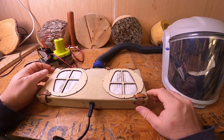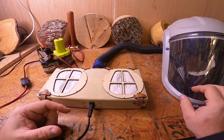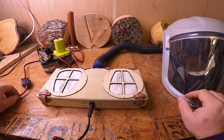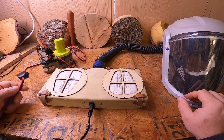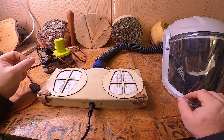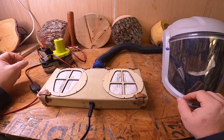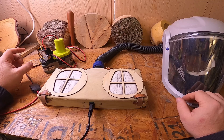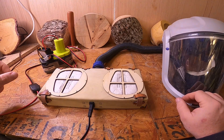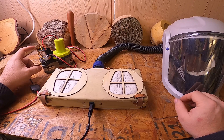Overall I think it works out quite well. I've used it a couple times — this was a little awkward but survivable. I did go from an odd connector on my first ones, but these worked out much better. The cable's not so thick that it gets in your way, but thick enough that you know it's there. It also provides less resistance to the output of the battery so you have less power losses — you'll actually see a little over 12 volts from a fully charged battery going through this buck converter. If you get the buck converter or buck boost, you can find adjustable ones, either with a pot in the back or with knobs on the front to change the voltage output.